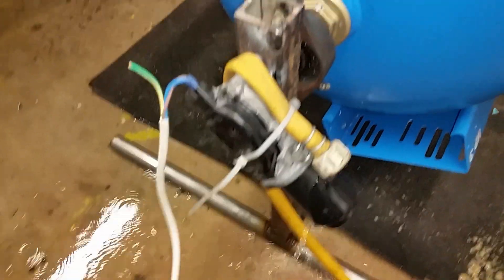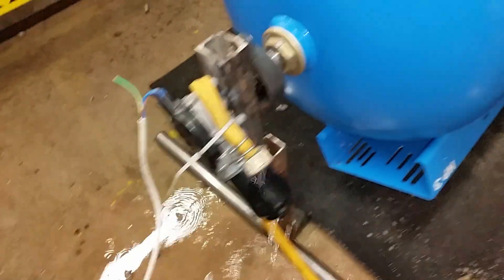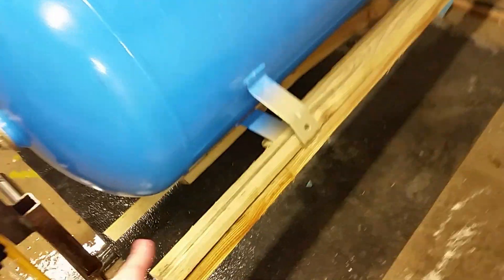This is the wiper motor on the tumbler itself, with two bearings. There are hoses on it to cool the motor because the motor would get slightly warm - it is a wee bit small for the job, because the weight of the media on the side makes it hard to start at times. These wood bits balance out the channels where the pumps used to sit, to create balance - just like a wheel in a car needs to be balanced.